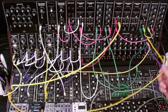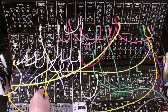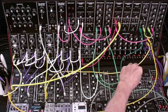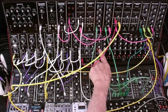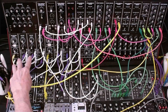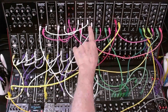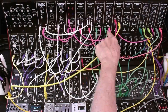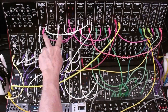At this point, you can see that the sequencer CV outputs are going to the two oscillator control voltage mixers. We're taking the oscillator output from the internal oscillator on the sequencer and plugging that into the 961 interface to convert it from a V trigger to an S trigger. And now when we play the sequence, you can hear the trigger. So we've got oscillator bank one all set up and bank two all set up. Bank one is going through the low-pass filter through the VCA, and bank two is going through the high-pass filter VCA. This is voice one VCA envelope, voice two VCA envelope, and we've got the filter envelope which is being shared by both filters. Let's listen to the sequence now.